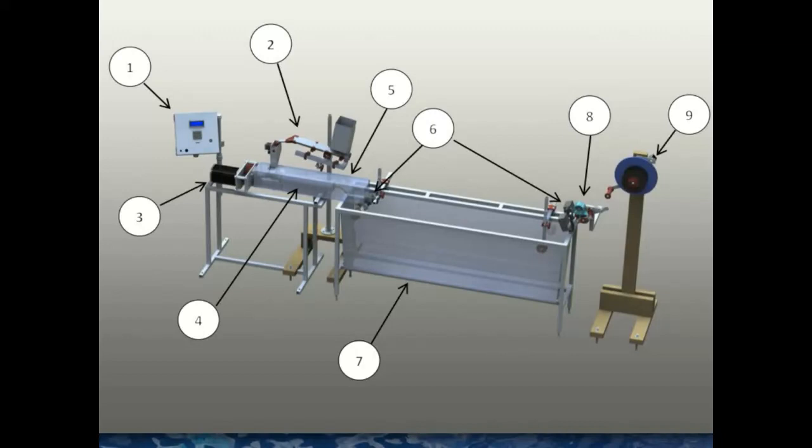If it doesn't spend enough time in cool water, it'll look amorphous and clear but then crystallize later. I've had filament where you extrude it, and the next day when you go to unspool it, it just snaps. We dried some filament in Nairobi at too high a temperature, and when we went to extrude it there was pressure between the hobbed bolts and the idler in the 3D printer extruder that kept cracking the filaments - we couldn't 3D print with it. Getting nice amorphous filament is critical.